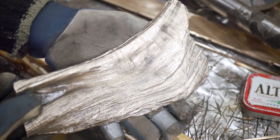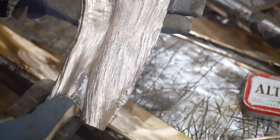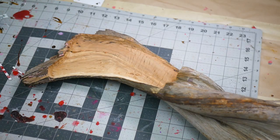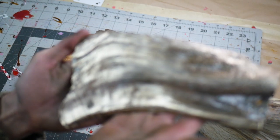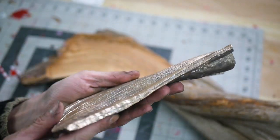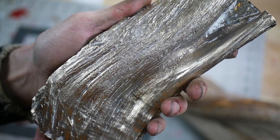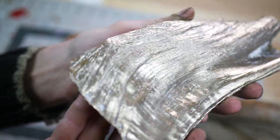Here you finally get to see the very detailed wood grain — it looks amazing and very sharp and detailed. This is the first metal inlay fit to see how well I did and how much the bronze shrank through the process. This is the first indication of how much and what kind of work I'll need to do to get this to fit back as intended.